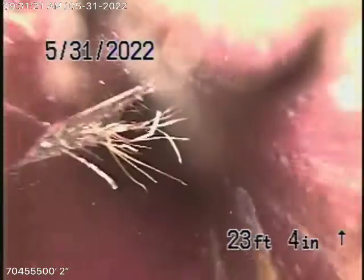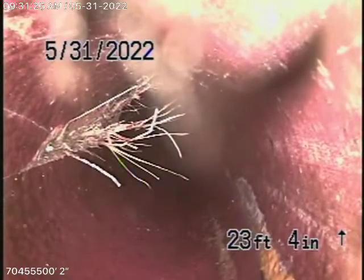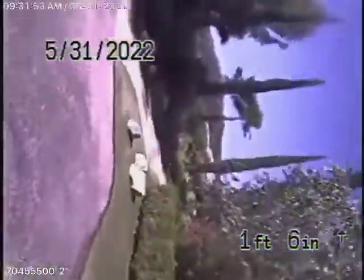Here the pipe is a little broken — you can see the pipe is broken right underneath this tree. It probably wouldn't be a bad idea to replace all of this pipe with a pipe bursting system. Where they put this clean-out, this whole area is kind of funky and it's very flat as we come out of the clean-out here.